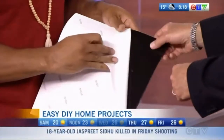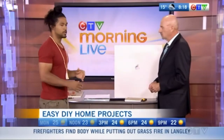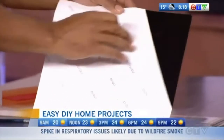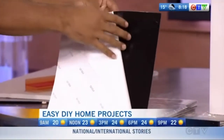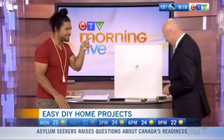You're going to peel the back off. Now it seems very simple, but here's the trick: before you do this, make sure your wall is nice and clean. You're going to want to take 500 milliliters of water and mix it with a teaspoon of soap detergent, and put that water on the back of the tile after you peel it off. You're probably thinking that doesn't make sense — you're going to ruin the stickiness. Well, that's what you want. You want it so that when you put it on the wall, you can massage it in and make sure those lines are perfect before it really grabs and adheres, rather than just slapping it on. Because if those lines don't line up quite right, that's all you're going to see — that one that's crooked.